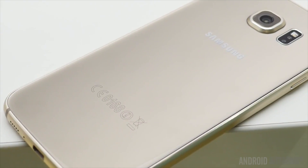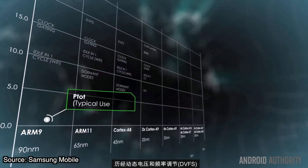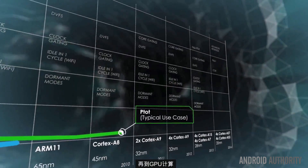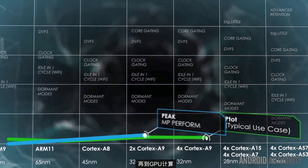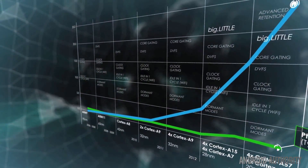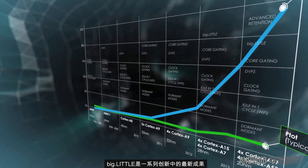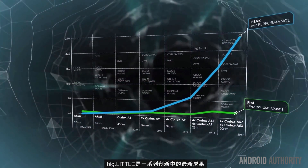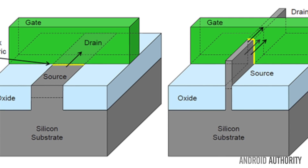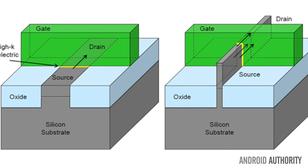So let's delve into the specifics. One of the Exynos 7420's big talking points has been the move down to a 14nm FinFET manufacturing process, which puts Samsung ahead of Qualcomm's 20nm Snapdragon 810. Because when it comes to manufacturing size, smaller numbers are better, as shorter transistor distances consume less energy and boost processing speeds. However, smaller, closely packed transistors can lead to current leakage between parts of the chip, an issue that FinFET manufacturing addresses.